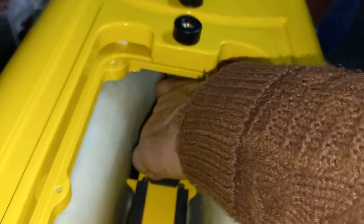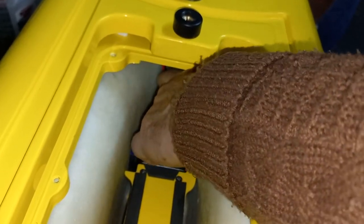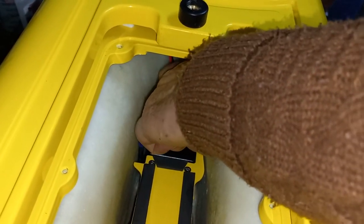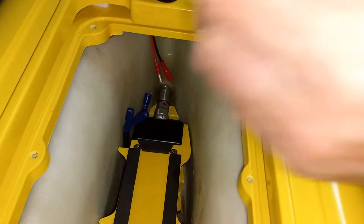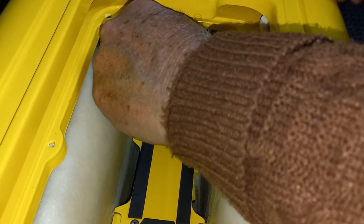You can tighten one of those gearbox screws thoroughly — fully in, fully tightened — then you can take the blade out so you don't damage your fingers. You'll see that there is a gap now between the two halves. Now you tighten the final screw.